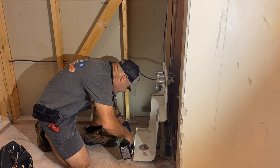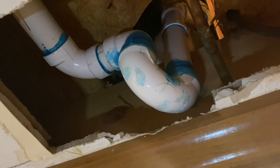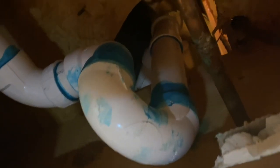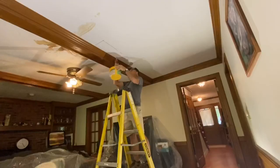Then I'm going to go to the ceiling below to find out where I come out. I like to find all the nice little surprises I can at the very beginning and then make my plans accordingly. As luck would have it, where that drill came out was right beside that beam — that's why you saw me making a 45-degree offset so we can get on the other side of this beam and put our trap on.